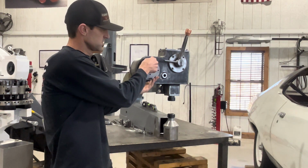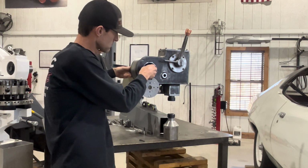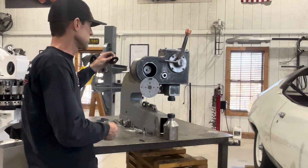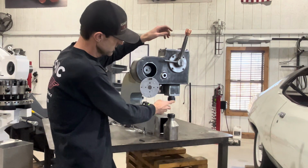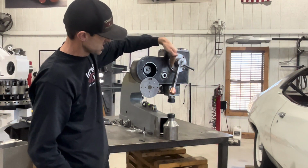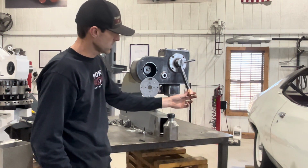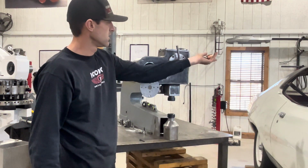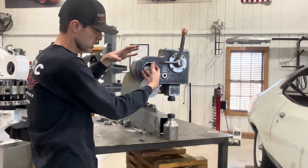But this here, it's just like a normal Pullmax. As you can see, this here rides on a cam, which I have the bearing. If you can see inside there, I have everything inside that's built except the big flywheel, is what I'm going to call it. This actually lowers down, so there's 3 settings. At this particular setting, the travel of this is only around 100 thousandths. This one here is around 120 to probably 150, and then this one here is up to 200. And I'll know the exact ones when I get the flywheel mounted to the connecting rod.